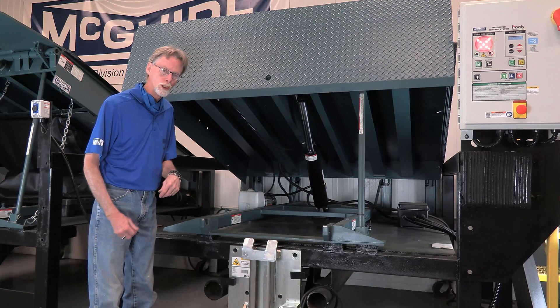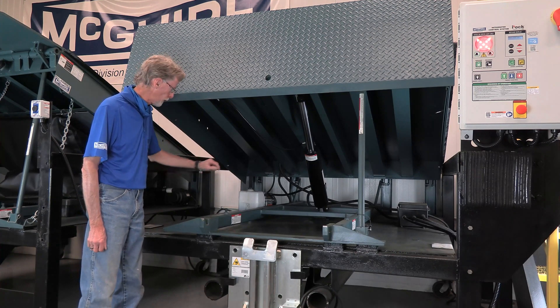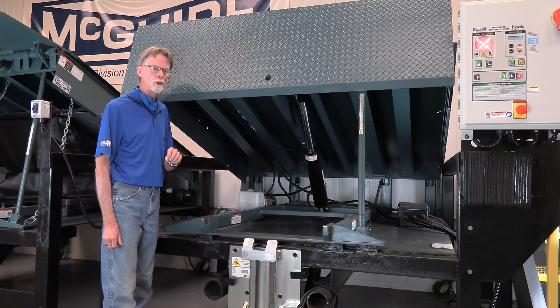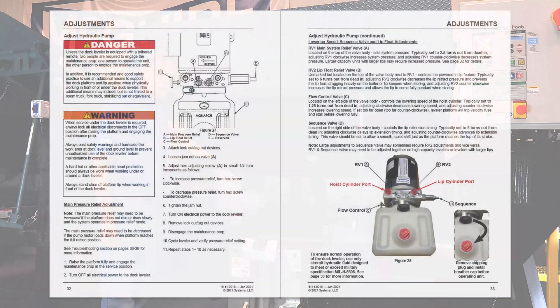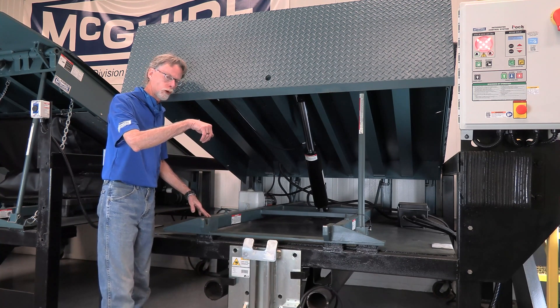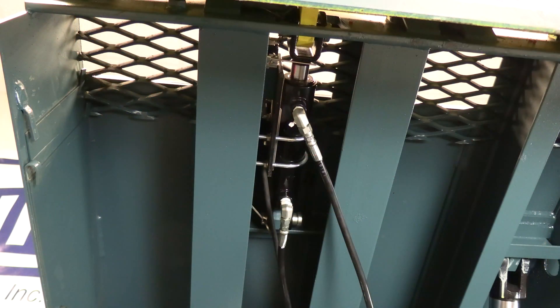As far as the maintenance and troubleshooting on this, you have a power pack. On that power pack are three very important features: you have an RV1 valve, an RV2 valve, and a sequence valve on the side. The best thing to do is refer back to your owner's manual. There are simple little adjustments that you can make an eighth of a turn at a time that either can make or break that power pack. Typically the only time you ever have to touch that power pack is when the leveler goes up and gets close to the end of the stroke of the hoist cylinder — that sequence valve takes over to extend the lip. That's the point where the RV1, RV2, and the sequence valve can at times become out of sync.